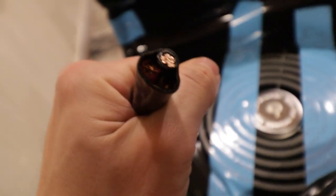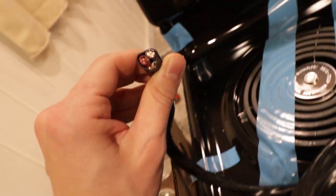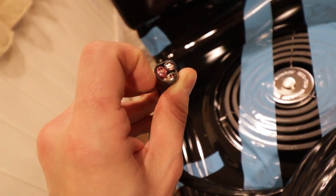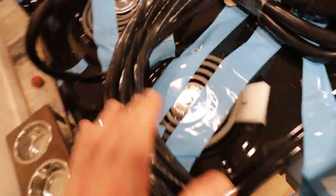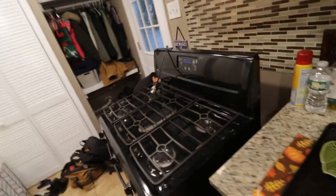This is six-three wire — there are actually four wires in there: black, red, white (your neutral and two hots), and a ground. If you have an older stove or house with only three prongs, I recommend replacing the breaker with a GFCI ground-fault protected breaker. If your oven's housing becomes energized, it'll shut the circuit off. Without further ado, let's get down on the frame.